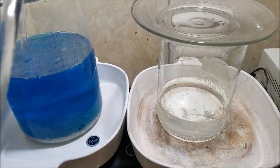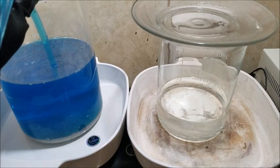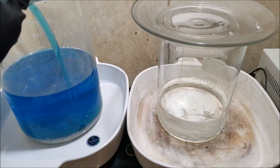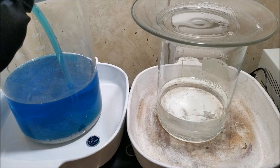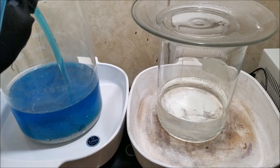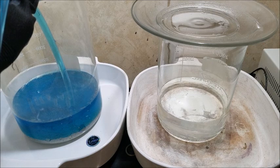So I have a siphon hose filled. I'm going to set that down in the front here, and the pot. Now I'll be pulling the remaining. There's not a lot of silver left in this solution, but I'm going to pull out what remains with copper in my stock pot. The last little bit comes out generally with a few more contaminants, so I'd rather just collect that all at once. I have 95+% of the silver dropped.